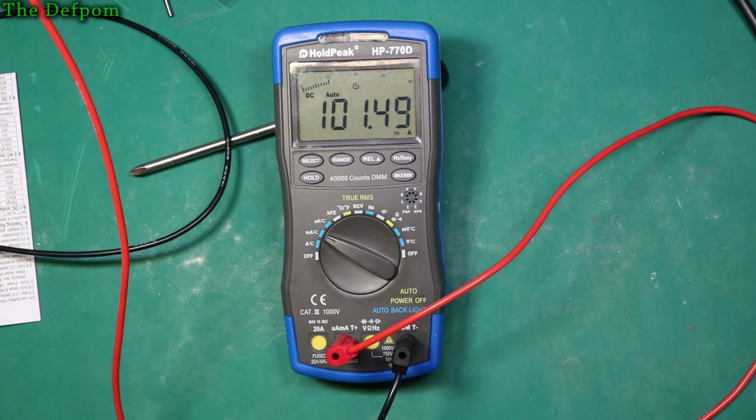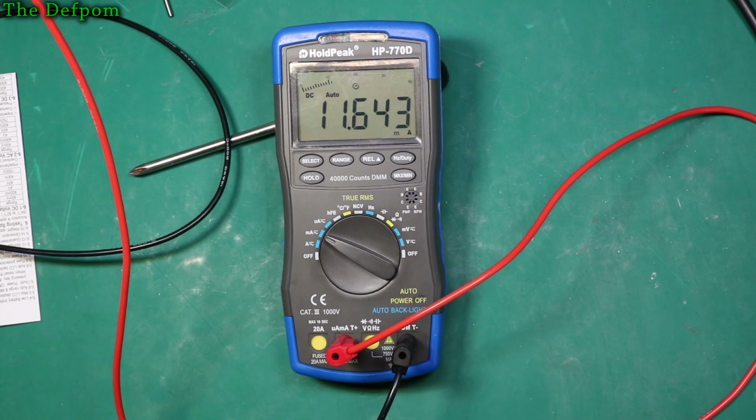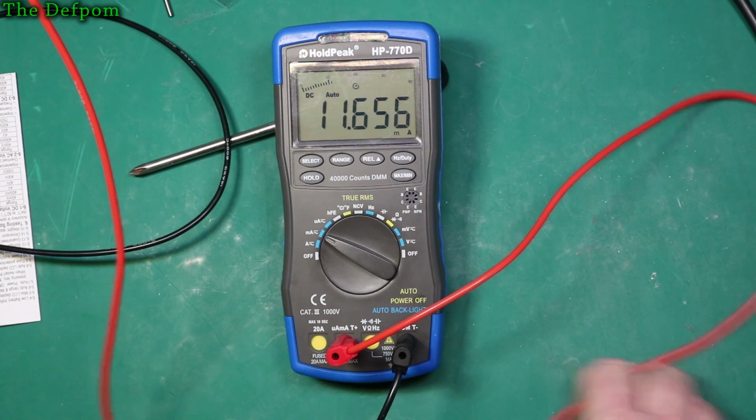And let's go down some more. Let's do 10 milliamps on the power supply there. Cool. This is measuring that. So we've got 11.66 thereabouts on the Siglent, 11.63 here. So again, it's really close. So yeah, it's all within ballpark. It's fairly accurate, really. It's not super high precision, but it's within the realms of acceptable. Certainly, it's within the specs. It seems to be, at least.